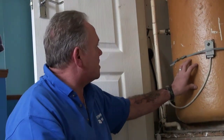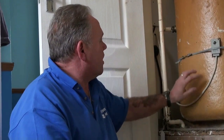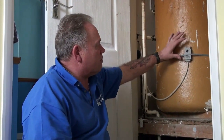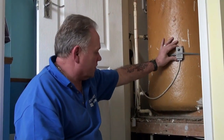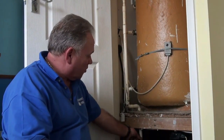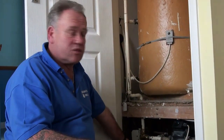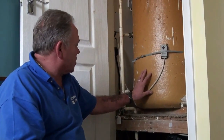So it's an incredibly efficient system which most of the time doesn't require you to turn the immersion on. There's a thermostat on the side of the tank and that measures the temperature of the water within. When it's reached the required temperature, it tells the valve that we've had enough water and we're hot enough — and it closes the port of this valve which sends the water up to the indirect system, and all of the water is diverted back down through the radiators.